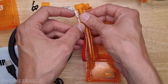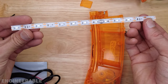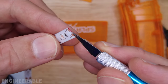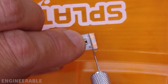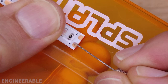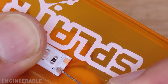I want the strip to go approximately like that, so I'm going to cut it off right here — that leaves us with 13 LEDs on this strip. The silicone that covers this strip will have to be removed on one end to reveal the contacts. Take an exacto knife and carefully remove that silicone strip. Then we need to clean the contacts off because silicone residue will prevent the solder from sticking — clean them until you see a shiny, slightly scratched surface for the solder to adhere to.